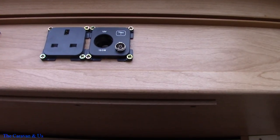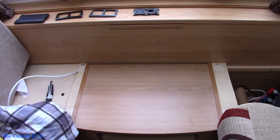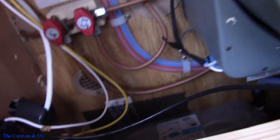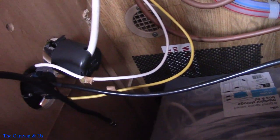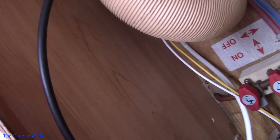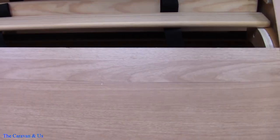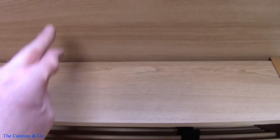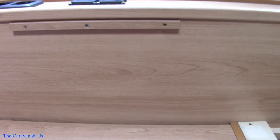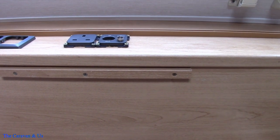So the sockets are in place. I've got the front chest of drawers out and I've unscrewed the sockets. I've also tapped the 12V off there, and I'm going to put an access hole through there which will come through into here. Run it up there, and probably around about there will be the access point to enable me to connect the cables.